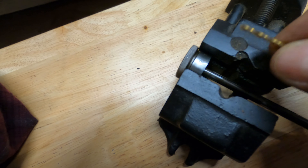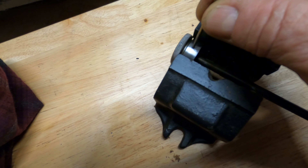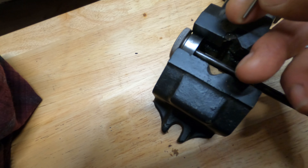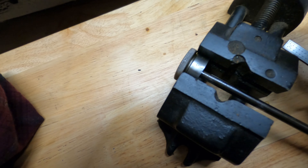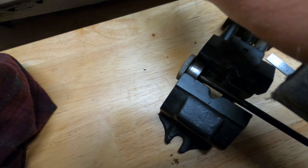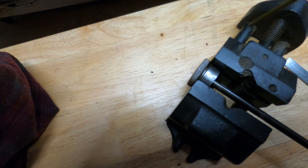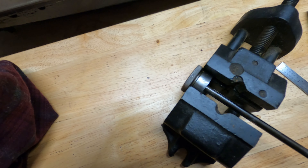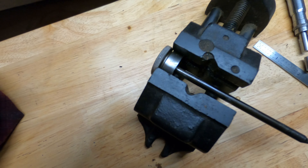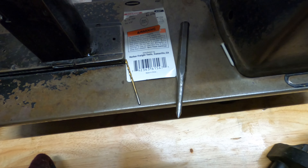I'll drill it in with this drill right here, and I might sacrifice the drill and just put it in there at the depth, peen it on either side so it stays locked in place, then grind it off. These are Harbor Freight drills — they're cheap. Or I might do something else, like a nail. This is an aluminum nail, or even a piece of coat hanger wire. If it's nice and snug — it's about the same size — I could always flatten it a little bit and tap it down and that'll stay. I was going to thread it and put a pin and go through this elaborate thing, but why? So what I'm going to do next is get the center punch right there, mark this, and punch it.